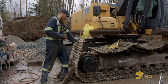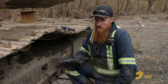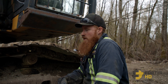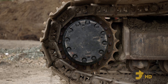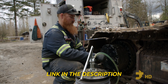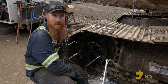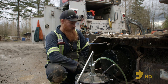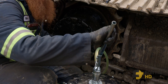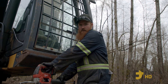Step 12: Put the track back together and grease it up. I'm just going to put a little grease in it here. While it's down, I'll lift the machine up. We'll run it around to adjust the tension as needed. The final step — fill the final drive with fresh oil. For a video on how to do that, there will be a link in the description. Now that we've got the final drive oil filled up and our track pinned on, we're going to top the level up to the proper level, tension our track, cycle it all around, and make sure it's all good to go. So that's how you remove and reinstall a new final drive on an excavator.